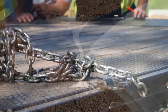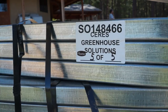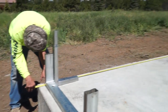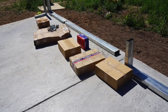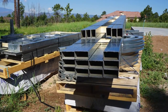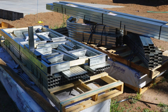The first thing that we do is go through the packing list and make sure that everything that was supposed to show up, showed up. The next step is to lay out your walls on the slab or on the foundation wall. It's always a good idea to place your materials when they arrive close to the build site, and it's also nice to not stack the pallets because it's much easier to access them if they're laid out individually instead of on top of each other.